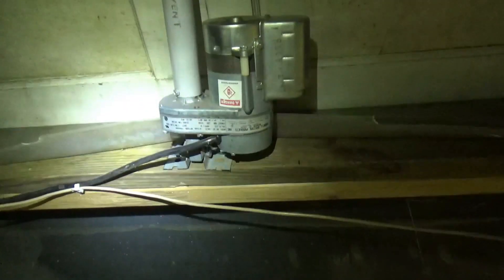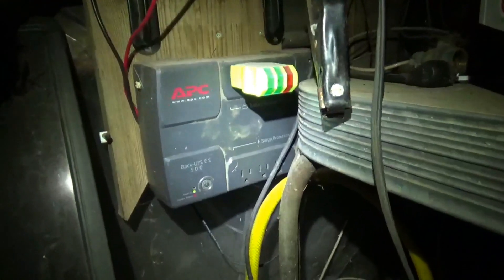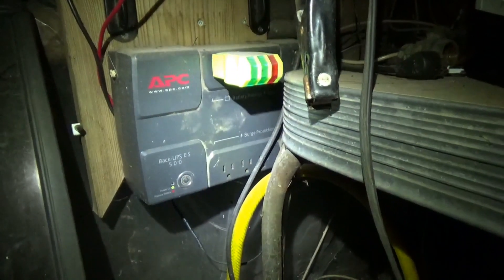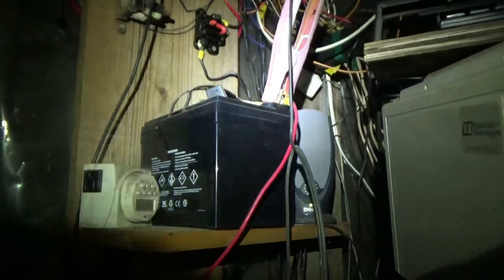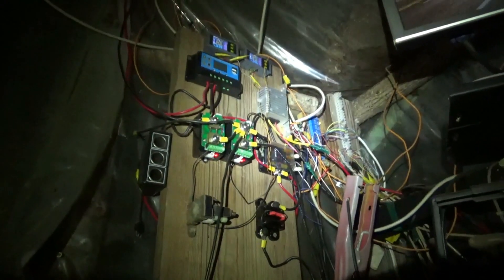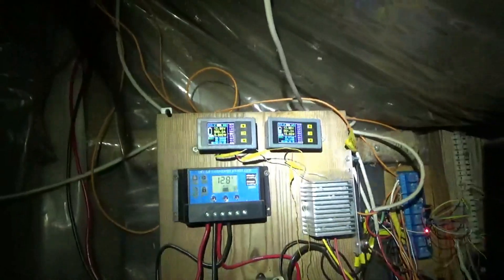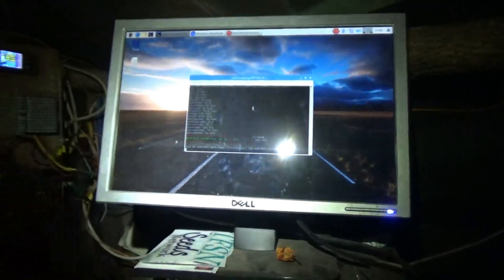I kind of cobbled the wire for these AC ones together. I'm probably going to pull that out and wire clean wires in. The other advantage of this is we won't need to be running another relay for the inverter — I basically took an APC BackUPS ES500 continuous power supply for a computer and scrapped it up as an inverter. It's actually running off the solar power system here in the greenhouse. There's a 100-watt panel on the roof and I picked up another 25-watt panel this fall. Two Bluetooth power meters — one monitoring power in, one monitoring power consumption — log that data, and I'll probably pull them into the Raspberry Pi database at some point.